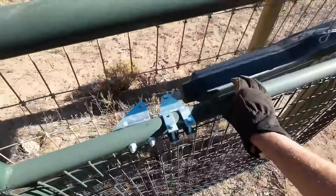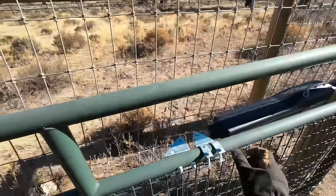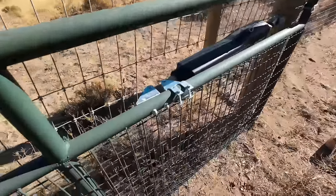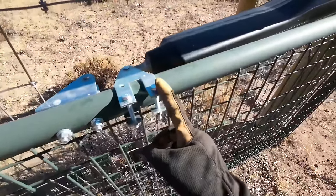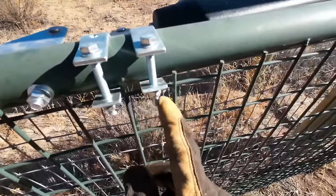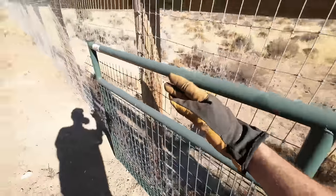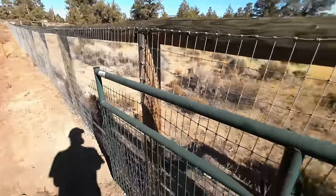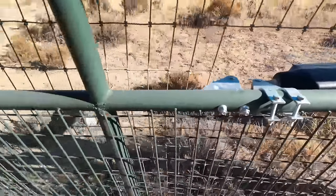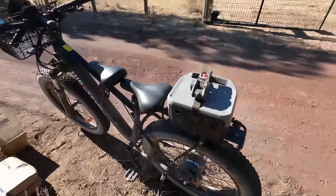The problem we're having here is this arm — when it's all the way closed, this gate is hitting up against the post, and it still has some pull to it so it's binding up. Something moved because it used to not do that. To fix it you need to slide this clamp over about a half inch, but this little bar is in the way. If I move it all the way to the other side the gate's going to sit out too far. So I'm just going to cut this little bar off and slide this up against that — it should give us what we need. We're just going to plug our grinder into the little power station and cut it.